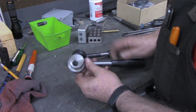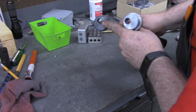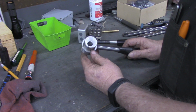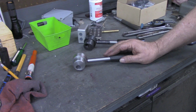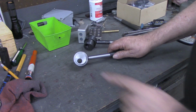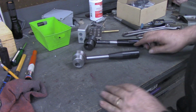But I still got to put the keyway in like this. But as I said, I don't have a broach. I'm going to have to make a broach to cut that keyway. So I think I'm going to conclude this video at this point. Next video, we'll make a broach and broach out this keyway and get this installed.